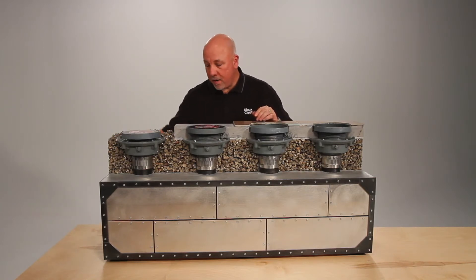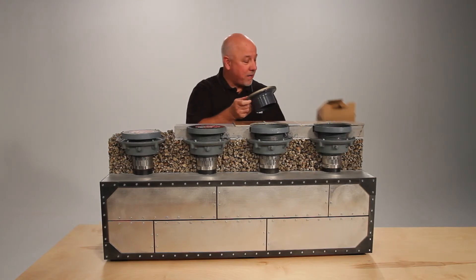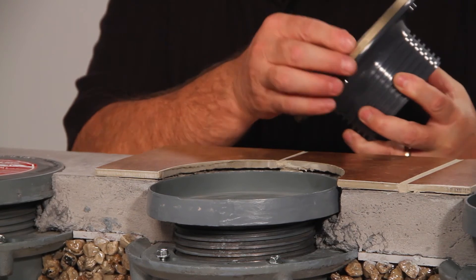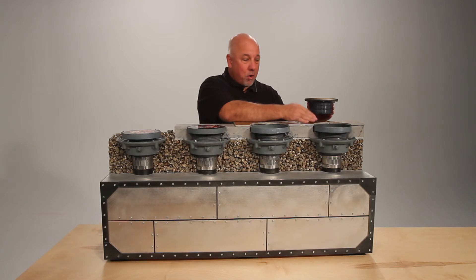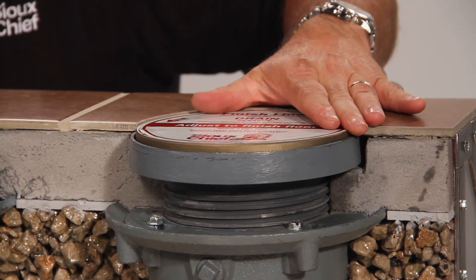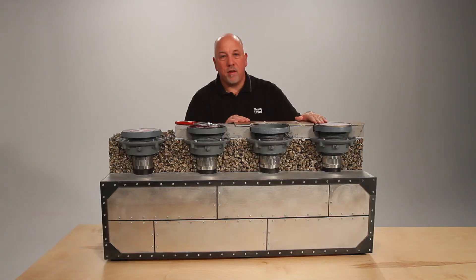The coring plug is set aside. Now is the time when we come in with the finished fixture. Again, the finished fixture has been protected in the job site trailer or somewhere off of the job site — it doesn't have any duct tape on it and it's a very nice clean fixture. Now we have the finished floor covering. The finished fixture goes in and is adjusted to the proper level of the finished floor. A bead of silicone on the threads will lock it into place. The Finish Line: a perfect finish every time.